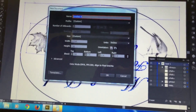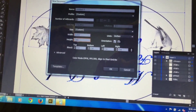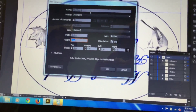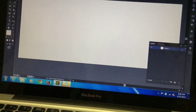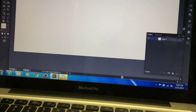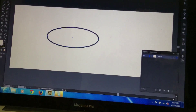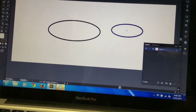I shut the lid — the laser won't run with the lid open. Back in Adobe Illustrator, now that I know the size of my material I need to specify the size. I've already put 2.5 inches in the width and 1 inch in the height — it says inches here, that's important. You can give your file a name if you want. There we get our big canvas. I can write or draw anything on here and it will etch onto the piece of wood. Those two circles right there would get etched into the wood.